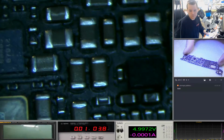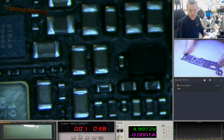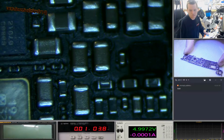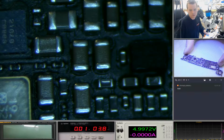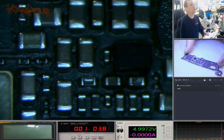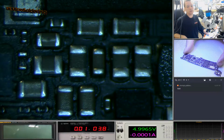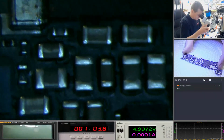Let's look here. Just want to have a quick look at what lines they are. Ground. Okay, 5V Sage, ground, V boost. Lots of different lines around here. Okay, yeah, that's a good place to start, I think. And there's VC main. Cool. Okay, so where's VC main? We're looking for two caps. That's VC main. Okie dokie. So yeah, lots of potential destruction.